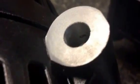Coming back to the visual differences you can see other than the finish of the housing — I'm going to try to zoom in close enough to show this. The machining on this Chinese unit has grooves in the actual mounting bolt surface, whereas the mounting bolt surface on the OEM unit seems very slick and polished. You don't see the machining grooves that you see on the aftermarket unit.